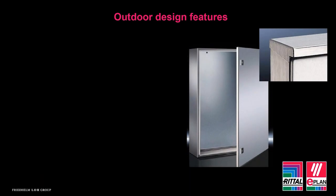If we look at the stainless steel option, then in order to make it a more outdoor friendly solution, we'd need to install a rain canopy to protect the seals. However, the enclosure again is still only single skinned. Now we established earlier that at times that's okay, that's acceptable depending on the application. But again, we need to consider that potentially stainless will corrode. It's significantly heavier and it will require a rain canopy to be added and it may not be as cost effective. So when you look at that overall solution, you need to decide whether that is the right option for your project based on cost, material, the extra works involved in making it an outdoor solution.